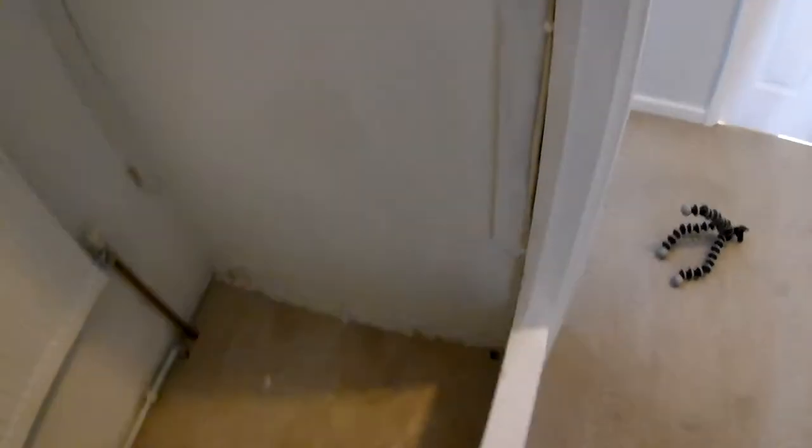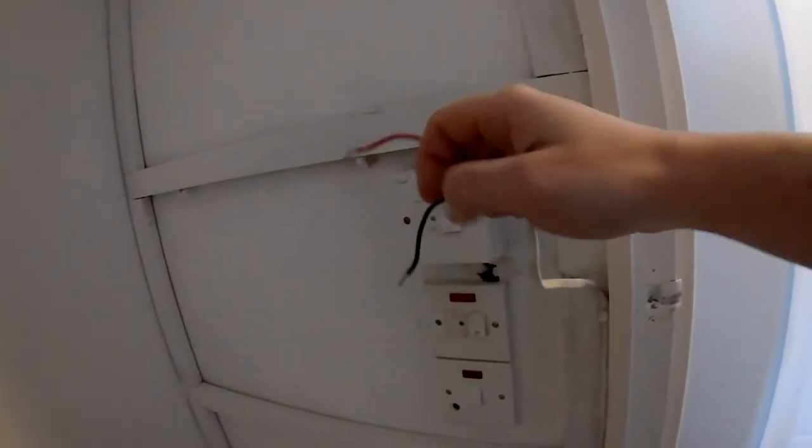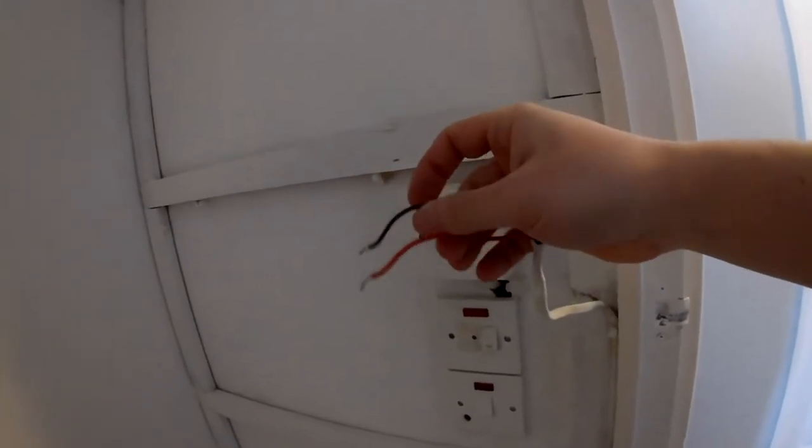Let's have a quick go at this framing because it's going to get a little bit in the way. This cable going down here runs off to the shower - it used to provide power to a power shower in the bathroom, but it's now disconnected at the top and these ends don't go off to the mains so they're completely safe. So I can just pull this cable out and I don't need to worry about that too much.